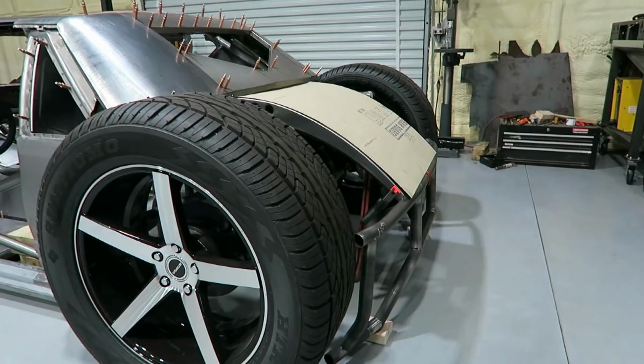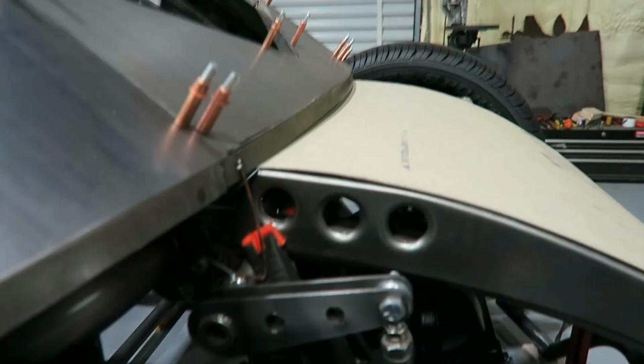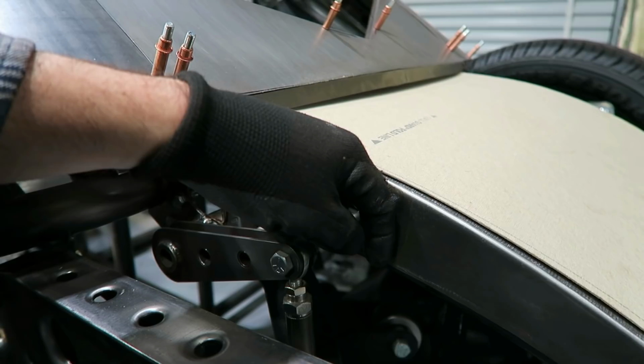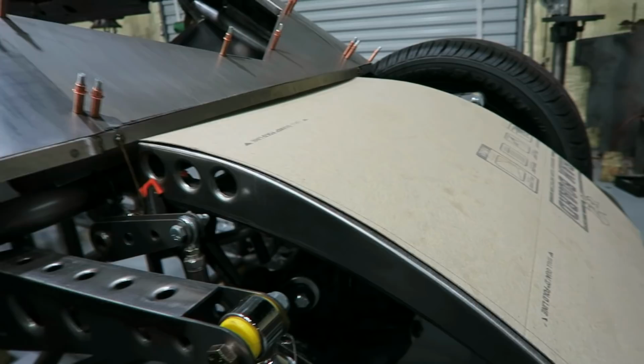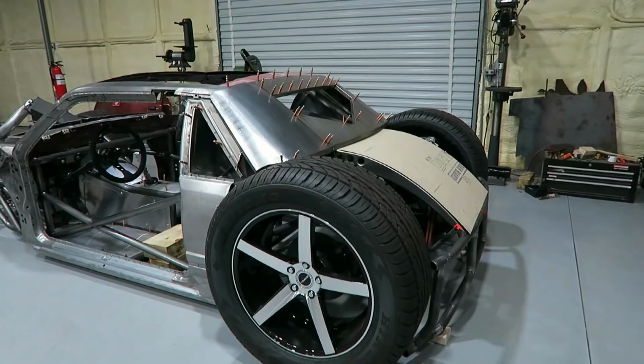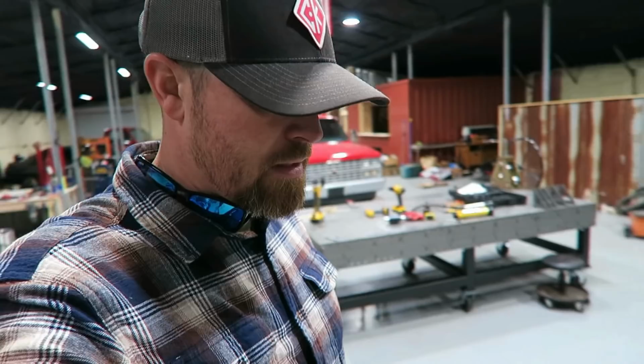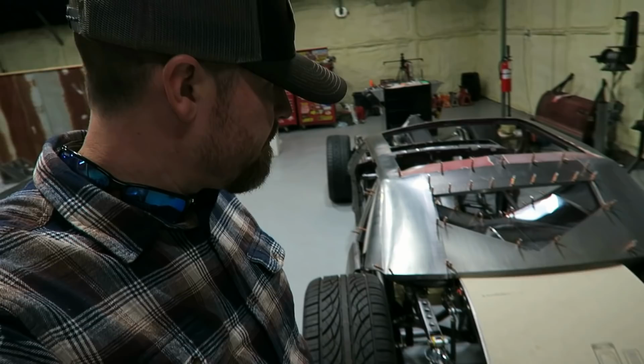Better, I think. Like it with just this smaller lip. And then also kind of dig the speed holes exposed. Now I have to build a flange that comes out and does something like that. So what I'll do is come back to that a little bit. I'll just cleco that thing to that tubing for now and start working on some of this outer section, maybe even roll that panel because I want to put just a little tiny bit of shape in it.